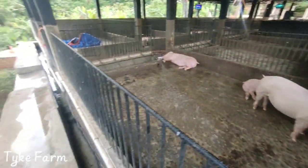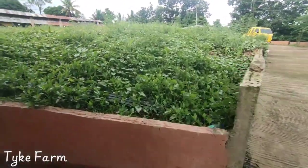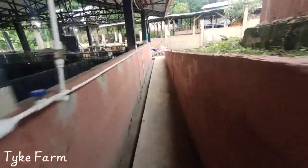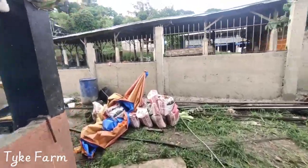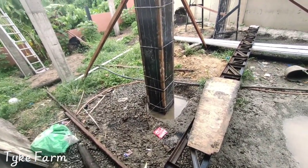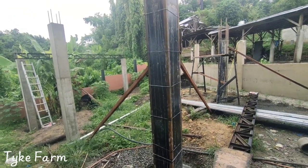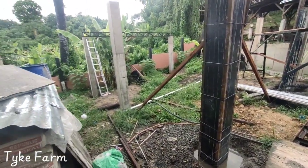So we did one this morning. They did start this afternoon on the second one. Just started, but then they left that. Then they went on to Soy's got everything squared up with the posts. He moved the forms across. I don't know if you can see the string lines, but they're all squared up and plumbed up, and they've been cast this afternoon. And the girders here are finished, ready to go on top of these posts, so that'll happen tomorrow.